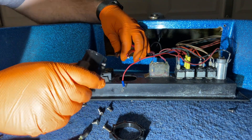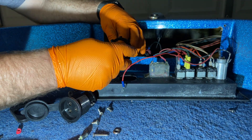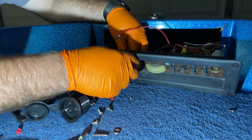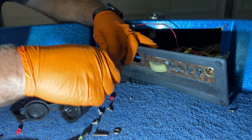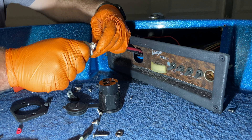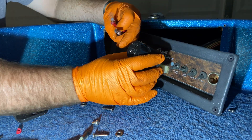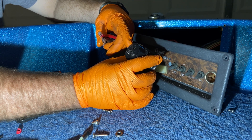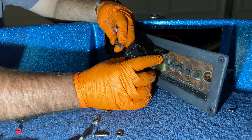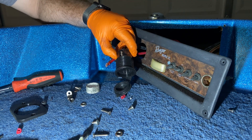I've got the insulation trimmed back on the wire, so we're going to get ready to put it in the receptacle. You've got to remember to put the backing nut and anything that needs to be on the wires into position before you put it through the receptacle. Then we're going to stick the wires through the front plate. We're going to use some dielectric grease on them, which is good for preventing corrosion. This has three different places for wire connectors — number one, two, and three. We're using two wires for our 24-volt system, and number one is the negative, so we're going to put the negative wire in first.